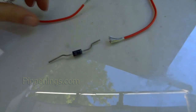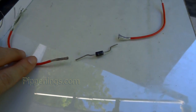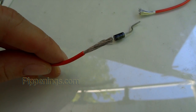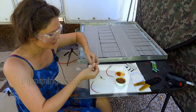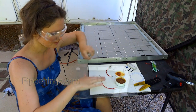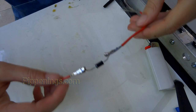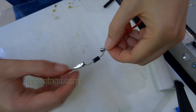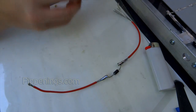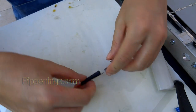I've got my two wires ready and my diode ready. I'm going to solder it to make a shape like this. I'll start by getting flux on my wires and on the diode leads, then get as much solder as I can on each element separately, and then solder them together. Once you've got a definite solid secure connection from your diode to your positive wire, you can take some heat shrink to keep the connection from being exposed.